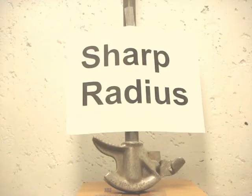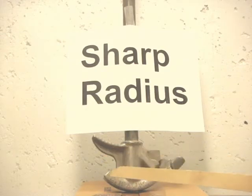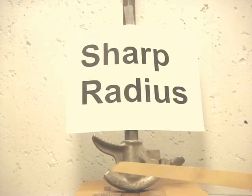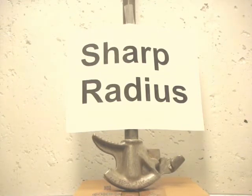This is a 1/2 inch thin wall, sharp radius bender. It bends a much tighter bend and is not compliant with the National Electrical Code. There are times, however, when it is the only solution and is sometimes used in those cases. This happens to be a Gardner bender model 929. They are sometimes available on auction websites or in equipment auctions.